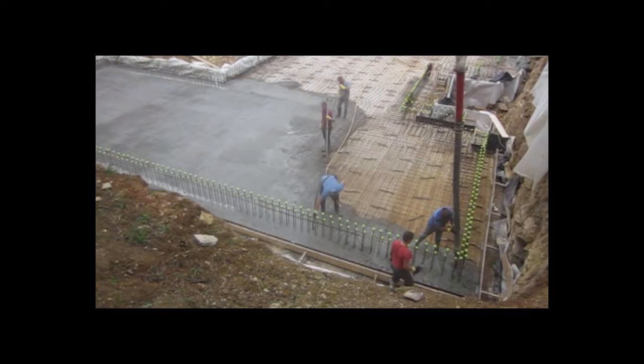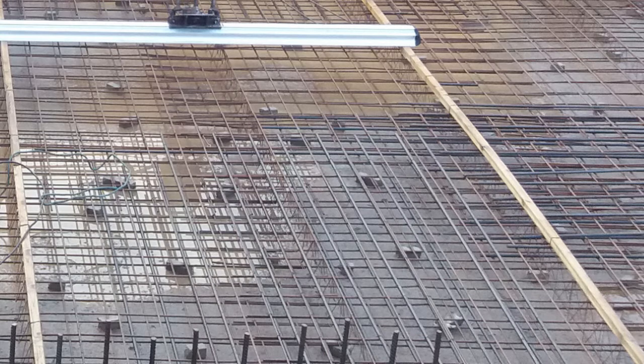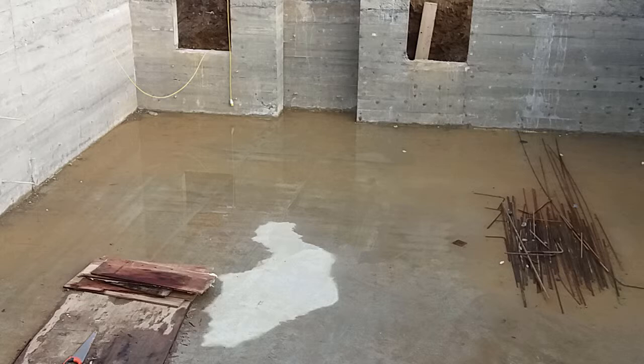A laser level is only okay if the team works together expertly, or the team can cheat by tying scaffold tubes down to the mesh. But both these alternatives result in puddles. Your client won't be impressed by puddles, and the workers don't like walking through water as they continue to build.